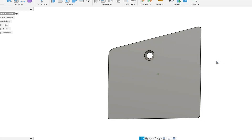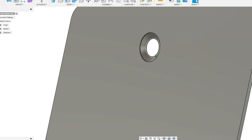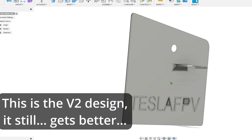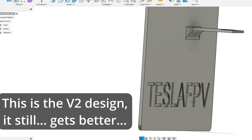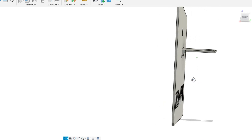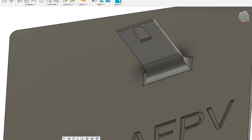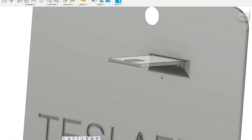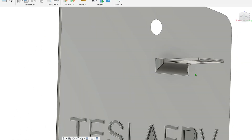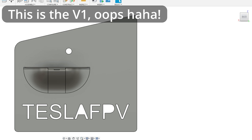Looking at the rear driver side version 2 in Fusion 360 — it has that same OEM clip area so you won't struggle putting them in. The dimensions are pretty much the same, but on the back I changed it so the letters are indented and don't go all the way through. That's better — you don't have to deal with resin, and you won't really see it from the front anyway since it gets caked with dirt. I also improved the bolt attachment area — it's now hooked around as one piece, and the material doesn't need to be as thick because TPU is really strong.